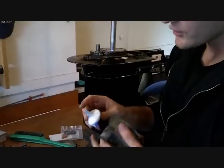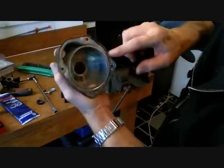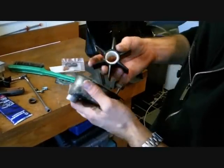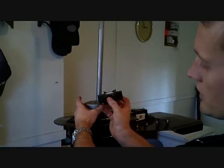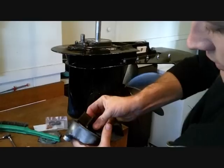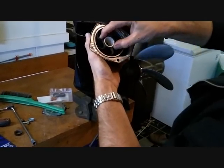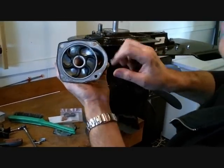I like to put a little bit of grease on the inside of your housing — not a lot, just a slight coating — so that when you start it up for the first time, it's got some lubrication and it's not rubber on steel. Because your housing sits upright and your engine always turns clockwise, when you're installing the impeller into the housing upside down, turn it anti-clockwise as it goes in. Turn it and face it to the side, with the keyway to the side of the housing for installation — you'll see why in a second.